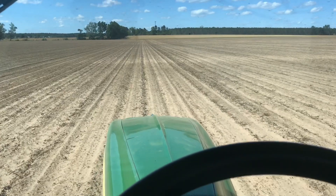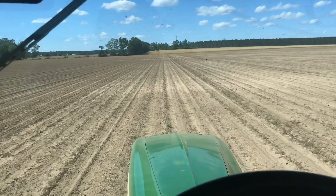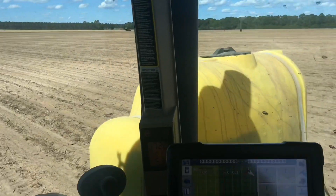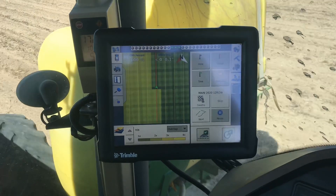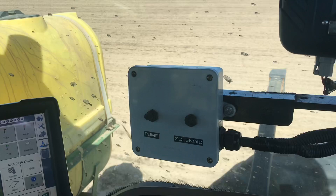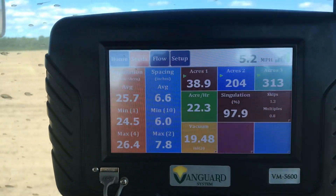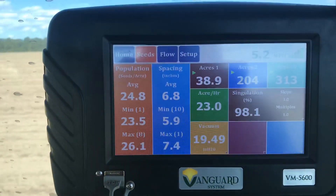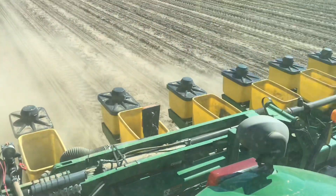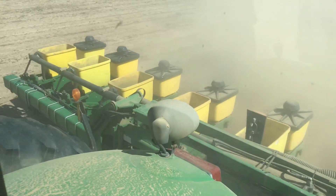Let me flip the camera around and show you what's going on. Here's kind of what my view looks like from the tractor - a view from the cab, if you will. Down here is our GPS, our autopilot made by Trimble. There's how we turn our spray on and off. This is our planter monitor - it shows all kinds of information. It keeps up with the acres you've planted, how much chemical you're putting out in-furrow, how many seed per acre, how many seed per foot, singulation, population - all that fun stuff.